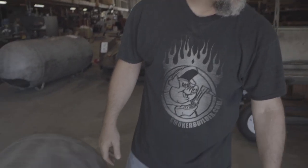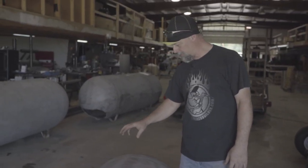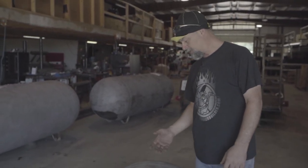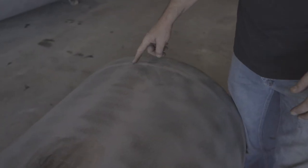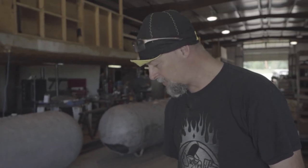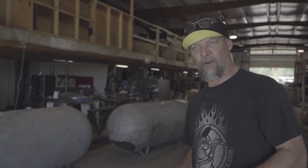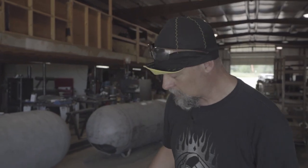We're going to lay out the top dead center mark now. We've got our tank level left to right here on the floor. The next part is we've got to have a good foundation for making lines on this tank. Two places that I pay attention to - place number one is the seam on one end or the other, just pick one. Personally on a tank, I use the center of the weld seam on the head as one line we're going to work with, because you never can tell which edge is actually straight. We're going to find top dead center and that's going to be our cornerstone of this whole project. So what we'll use is a couple of tools - let me grab them.